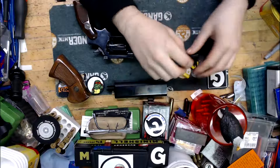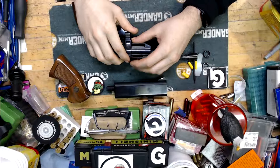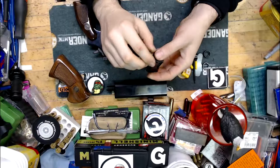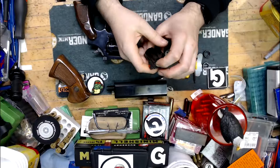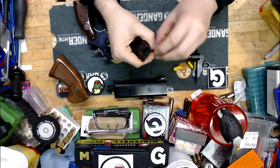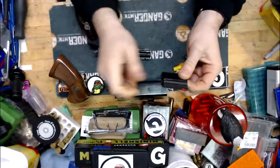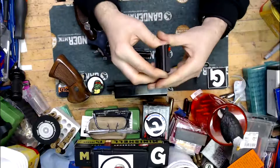The barrel shroud — which most people would think is the actual barrel — is basically just a big hunk of steel that has your front sight and ejector rod shroud. It slips over the regular barrel. It has a fairly deep counter bore that the barrel nut sits into. That little shelf puts tension on the barrel — pulling it front to back while compressing the barrel shroud, giving the Dan Wesson its rigidity.